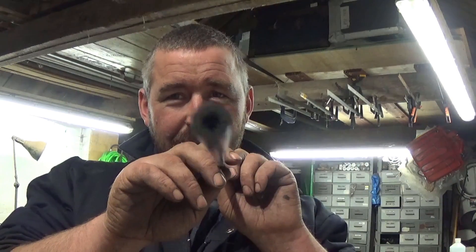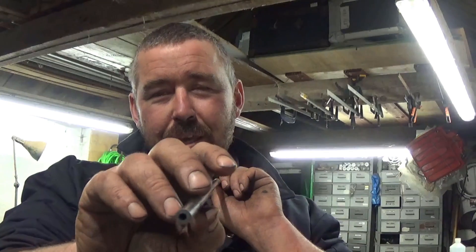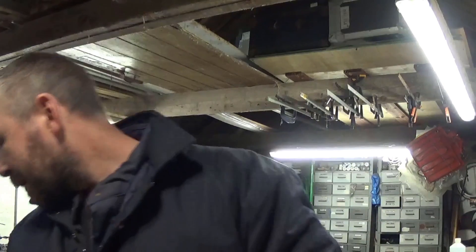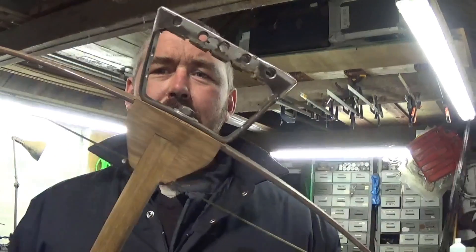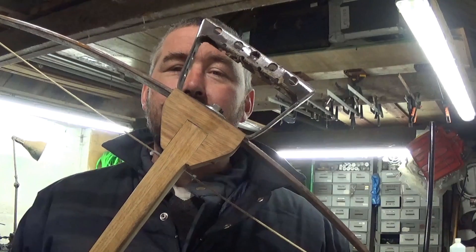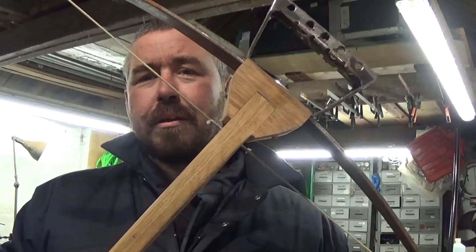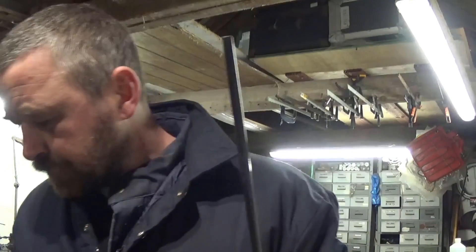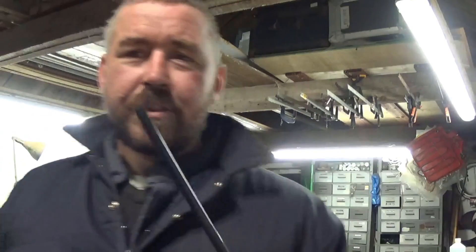This has a very heavy wall thickness — 8mm OD and 3mm ID — so these are heavy. You probably wouldn't want to use them as an archery bolt or in a compound crossbow, but this crossbow is never going to launch bolts that fast. It's a recurve bow with an iron prod, so it's slower, but that means you can launch something a lot heavier, which is what we're going for.